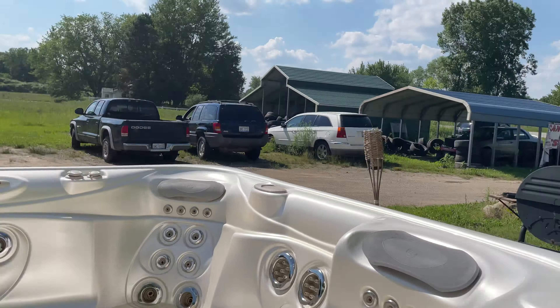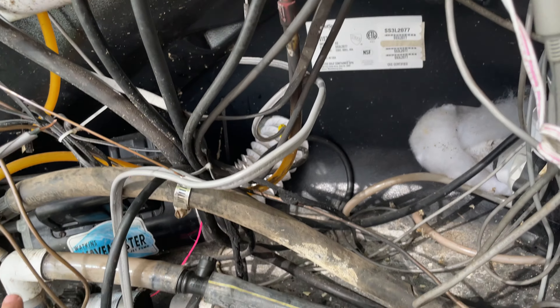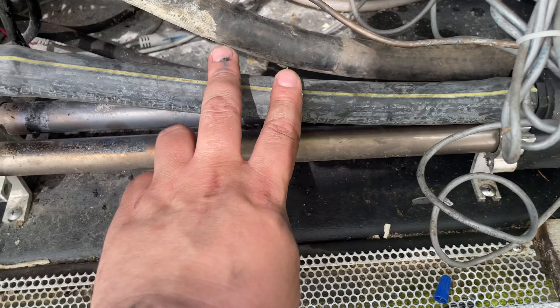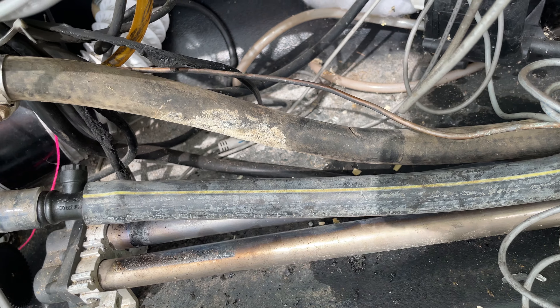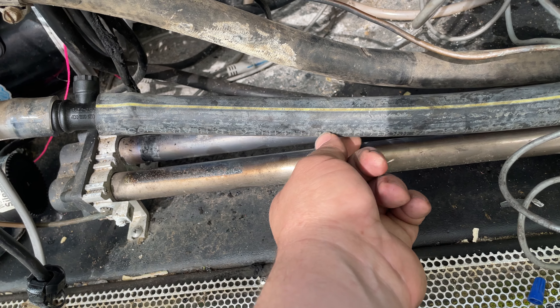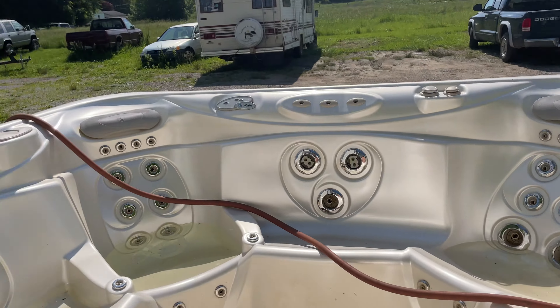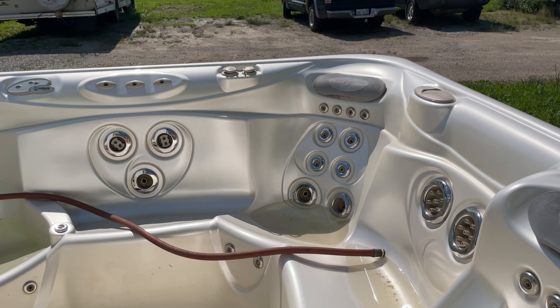These pipes were sitting too close to the heater — the heater was getting too hot because the pump had shut off. There was also another leak down here on this little hose; the hose clamp just needed to be pushed forward a little bit. I replaced those hoses with some car heater hose — don't recommend you do that, but that's what I had laying around. I'm not going to be running this heater, but if there's holes in it you're losing water just like the bad old pipes. Alright, so that was today's project — hope you liked it, good times.